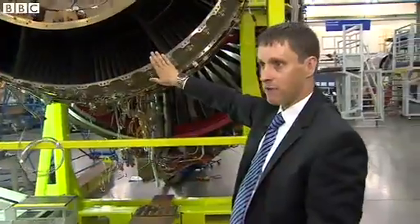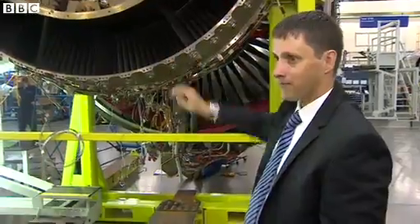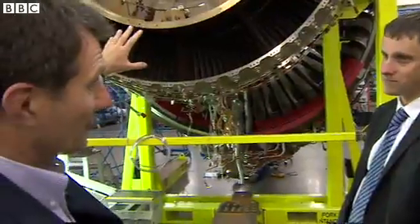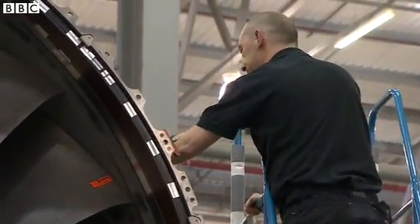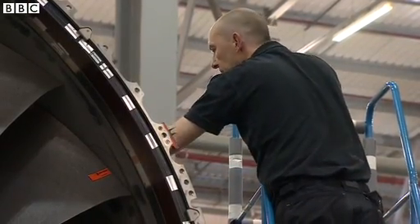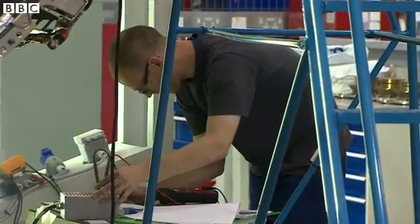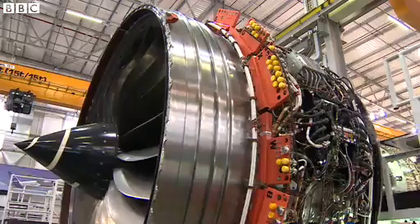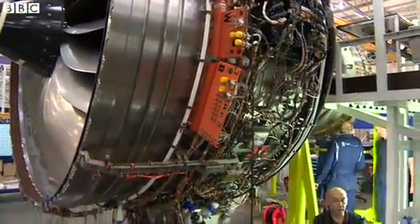All the power that comes out of these turbine blades turns that fan and allows that 1.3 tonnes of air a second to be compressed and accelerated by the fan, which provides the thrust. Each one of these at takeoff power is capable of 84,000 pounds of thrust. I know we're the first TV crew allowed in here to see this engine, but there are all kinds of secrets locked away, because it's a highly competitive business — we're all improving by about 1% a year. There are huge amounts of technology investment that go into creating the secrets here, not just in the individual technologies, but how to manufacture things, how to integrate them all, and how to model the engine to make it as perfect as it can possibly be.